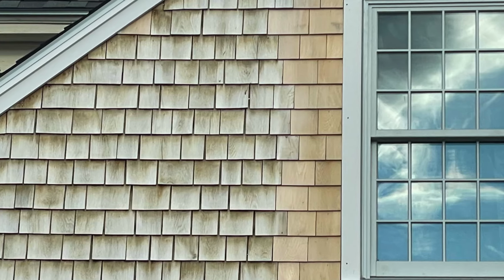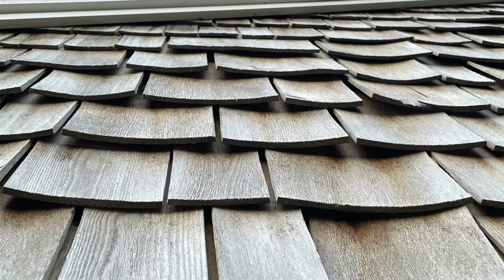And I'm telling you, these buildings, their siding is going to have to be replaced before the siding is 15 years old. They're not going to get half the life out of that they should, because every time they clean it, no matter how gently they're cleaning it, they're inadvertently and unavoidably stripping away some of the protective oils that make that wood so long lasting. And not only does it strip away life from the shingles, but after a couple cleanings, that wood starts to look pretty rough. It looks washed out. The shingles start to deform, they're cupping, they're curling, because they're losing those oils. Things are shrinking and shriveling.